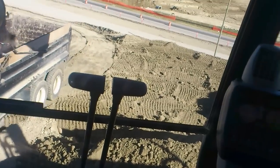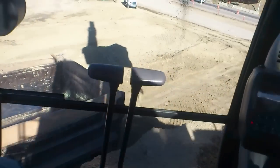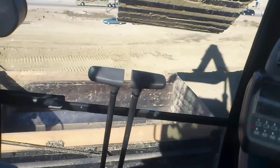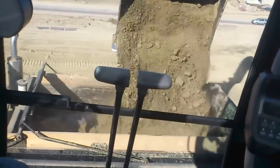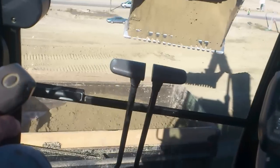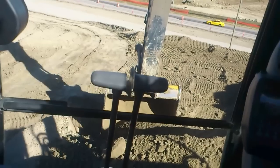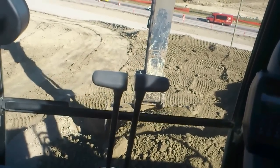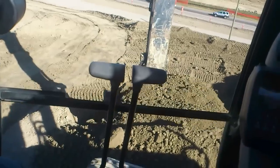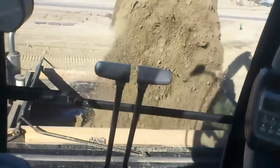We're using a John Deere 450D. It's got quite a large bucket on it too. As soon as the dump truck stops, we dump our first bucket in. Small angle to our next one. We've got a large bucket — the key to loading quickly is using your bucket the best you can. And there you've got a mounted bucket, drop it in.